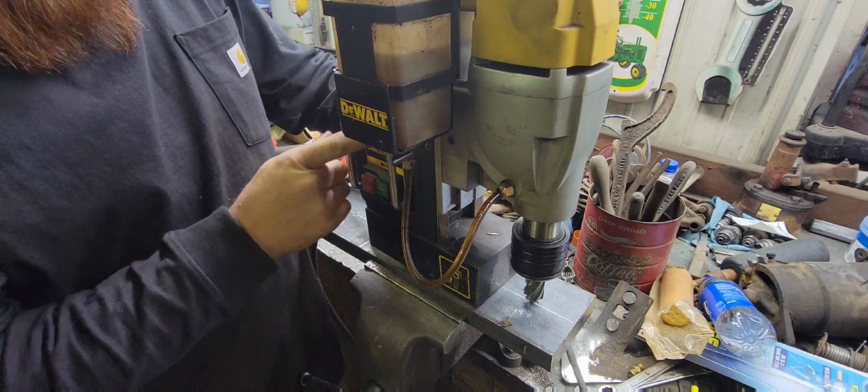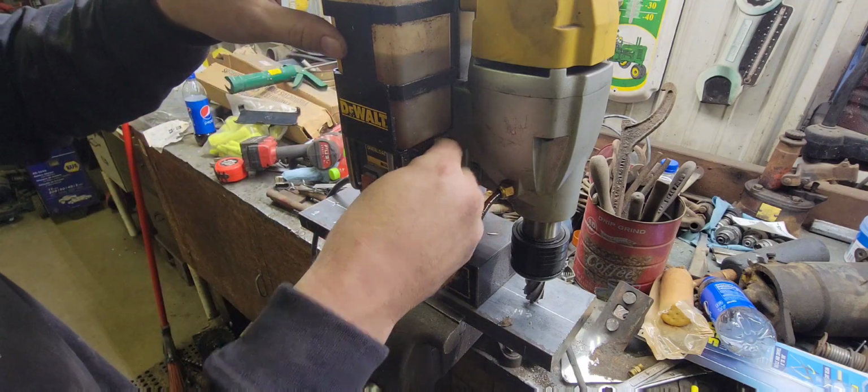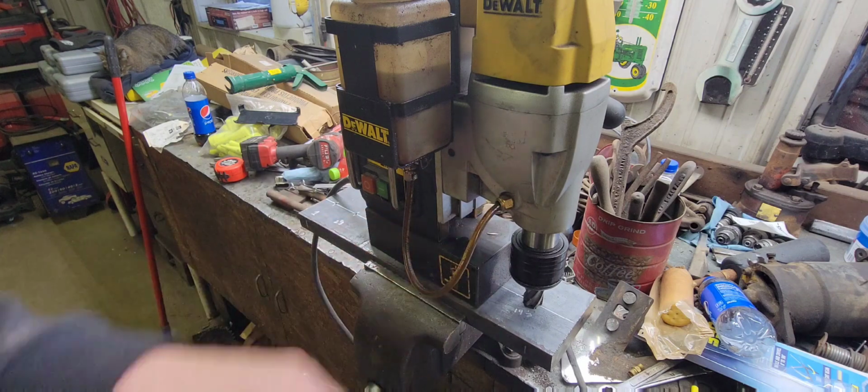We're going to magnetize the drill. It sucked down fast to the plate. We've got our oiler on. We want to let that sit there and let some oil run down in. When the centerpiece of that bit pokes up in, it actually triggers the oil flow to happen.